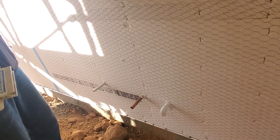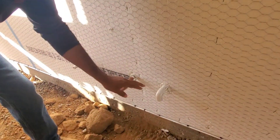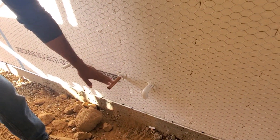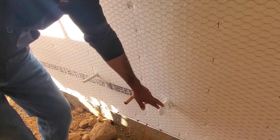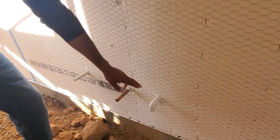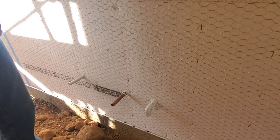On the inside of the garage in this location, this is where your tankless water heater will go. The tankless water heater vents to the outside and drains to the outside. This is the condensation line for the tankless water heater — water heaters now have condensation lines. This right here is your heating and air conditioning primary condensation line. With new mechanical equipment, when you run your AC in summer or heater in winter, it's going to drip.